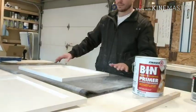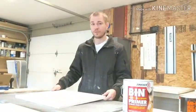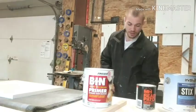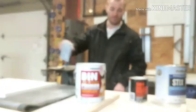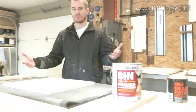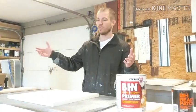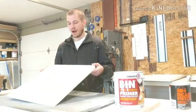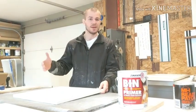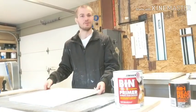After all of that is done, the doors should basically look like this but not shiny because they don't have a top coat yet — they've all been primed and pore-filled. Then all you need is a hand-block sander to just barely scuff it up and take it down those little notches. Then it's time for your top coat. I use Scuff-X, which is a fantastic product. You can use Kelly Moore Dura-Poxy or whatever you want. I used Scuff-X and it came out perfect — just like a brand-new maple door, even though these were golden oak stained from the 70s or 80s.